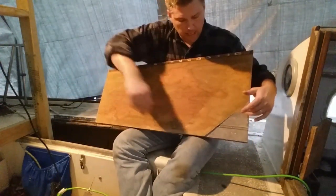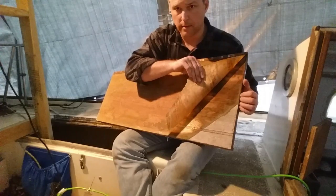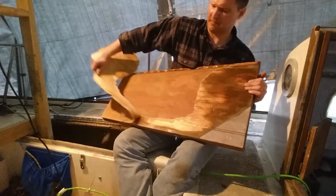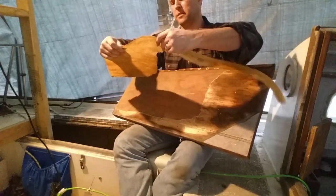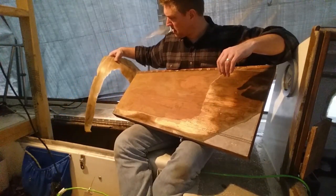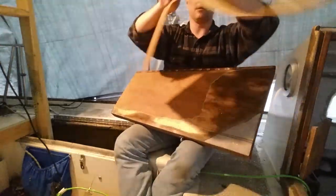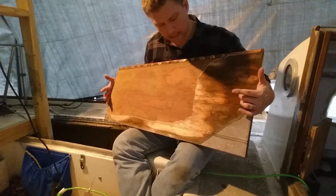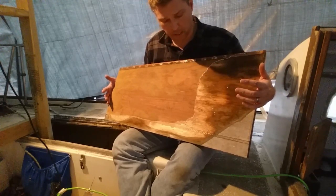Now, this was fiberglassed over. You can see the discoloration here between the wood, so I'll sand it down, see if it can be saved. Obviously, yeah, it's fiberglass. So we'll sand it down and then I'll make a decision as to whether I'm going to keep the wood on top, try to condition and varnish it, or stain it epoxy and then maybe varnish.